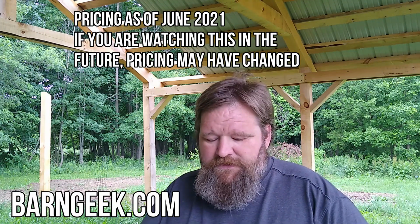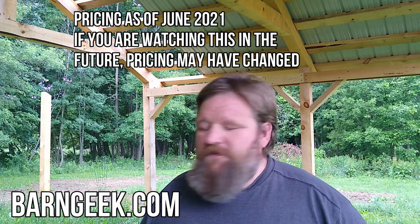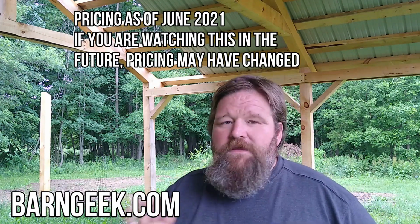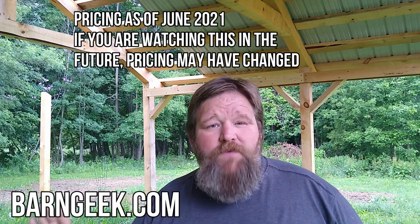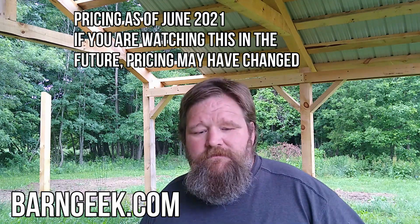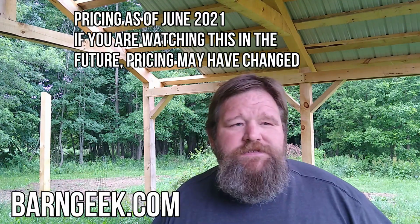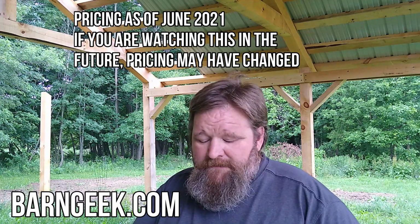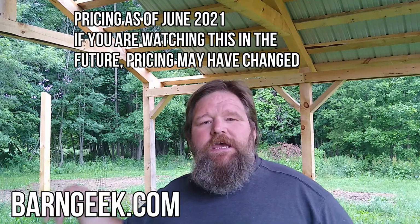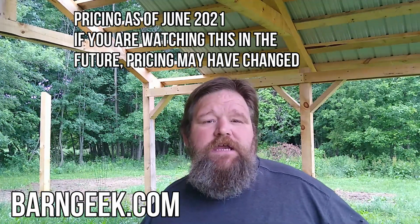And then, of course, you have an additional 2,000 board feet of lumber. That would be your siding and your girts. You have girts like these up here above me that go all the way down the posts, and then 1x10 board and 1x3 batten siding to go on the side. So you add all the lumber together, and you're looking at around $3,000 worth of lumber, and then $1,500 worth of steel. So you've got $4,500 there, and then the $800 for hardware. Add all that together, and you're looking at $5,300 for material cost for this particular design as a garage.